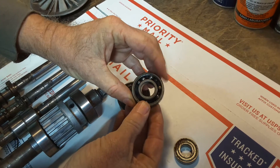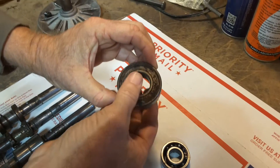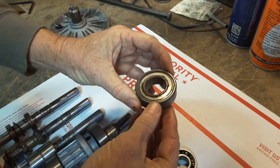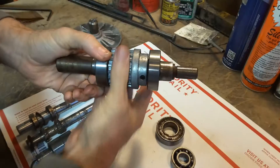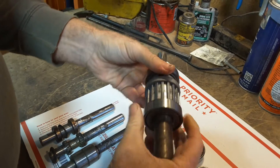This was from a motor — the motor bearings are the next larger size. These are your drive sleeve bearings. They go bad too. This one I can barely turn, but you can see grease was coming out the side of it. The drive sleeve has a lot of downward pressure from the belt pulling in one direction all the time — the tension. So after 10 or 15 years, they're usually needed.